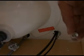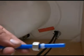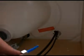We're now going to take the purified water line, which is the blue line, and slide on the compression nut. Next, go ahead and slide on the plastic washer. Not all systems come with one, but if you have a little plastic or brass insert, go ahead and slide it inside of the tube. Then simply screw onto the bottom of your faucet. When you're done, tighten all the nuts down and you now have your faucet and product water line completely installed.